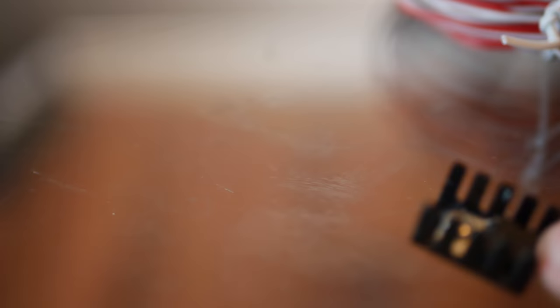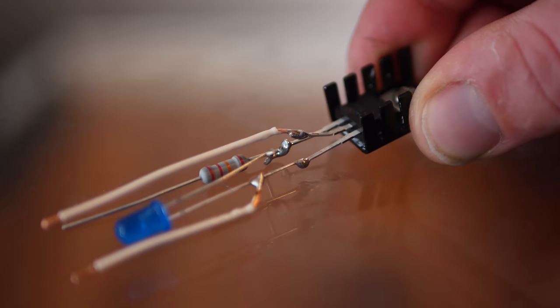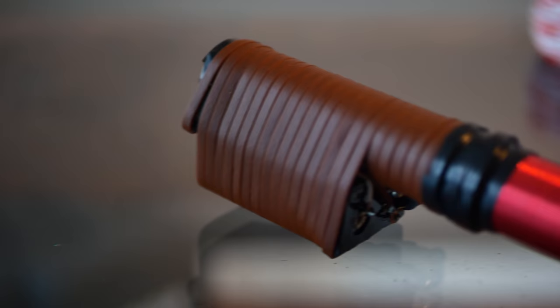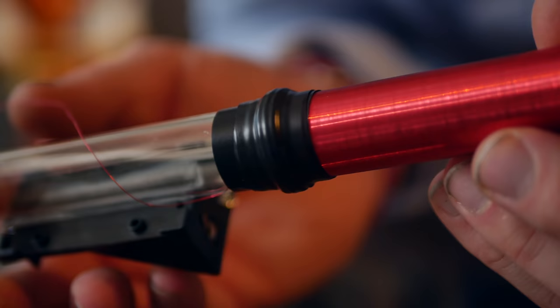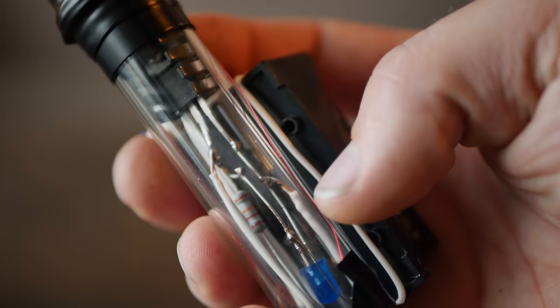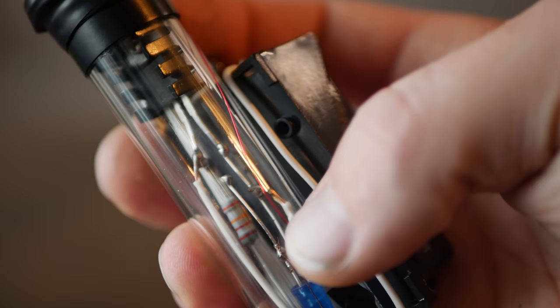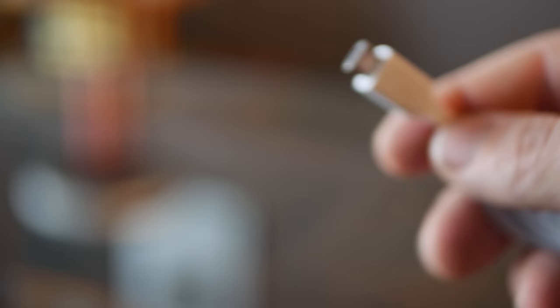While that's drying, the oscillator needs to be wired up. So take the transistor and wire the resistor and the LED into place. Next, you'll want to add bell wire to both the emitter and collector of the transistor. Afterwards, wind the primary coil — this consists of three turns of bell wire wrapped around the close end of the secondary. Tape it into place. The circuitry can now slide directly into the handle and the connections to the primary and battery can be added. And don't forget to solder the ground of the secondary coil to the transistor base.